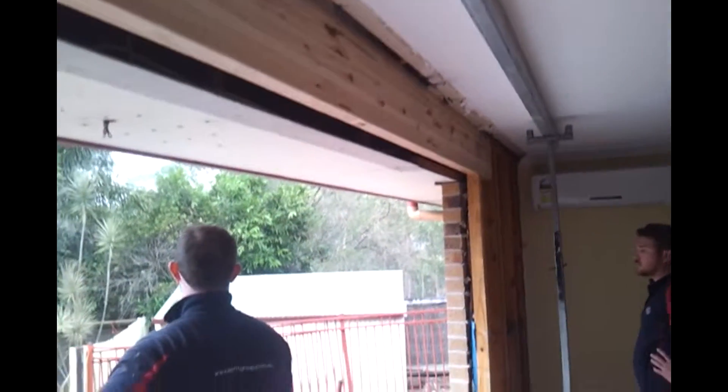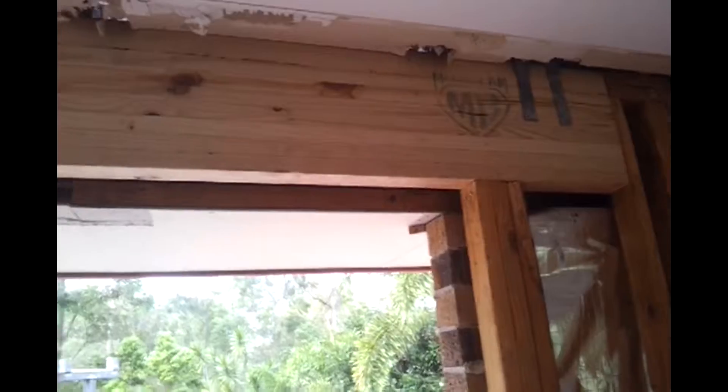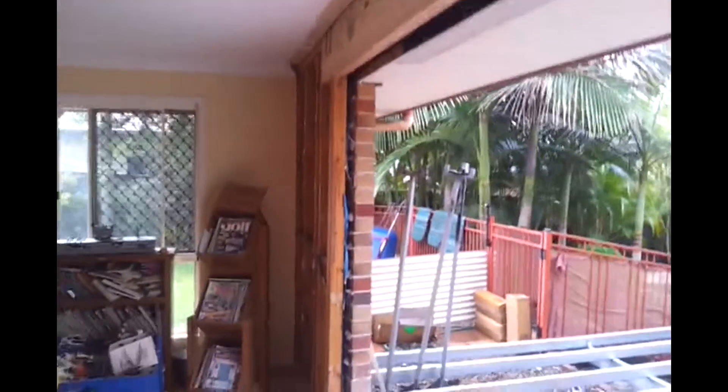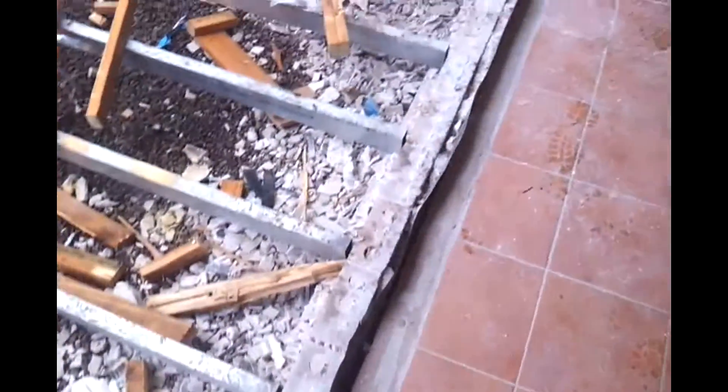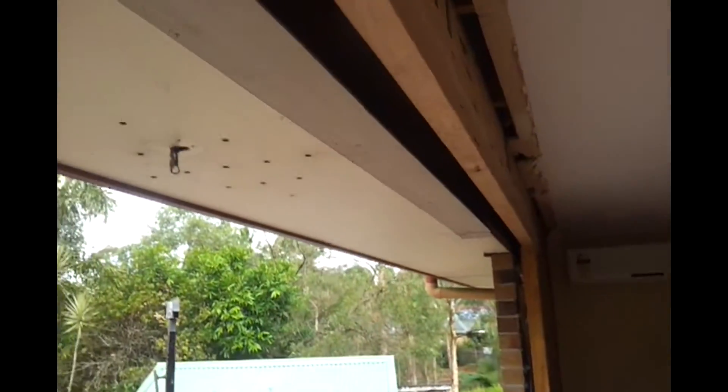It's all nice and sturdy - that beam's spanning that quite easily. We just got to put a few more extra studs in and then we'll have to put the door in, so hopefully later today we'll have a door installed. Just showing you the framework before we cover it all - cyclone straps are all nice and secured onto our beam. On this side we've got a watertight flashing there, we just got to fold that down where the concrete is, and the door will sit on top of that, so it should all be watertight. Even though we're putting a flyover roof there, it's always good to make sure you have it watertight.